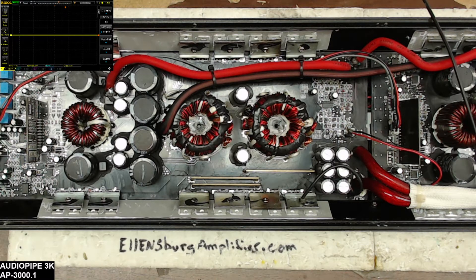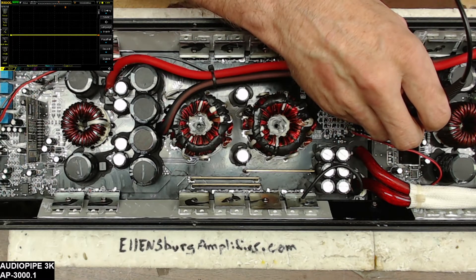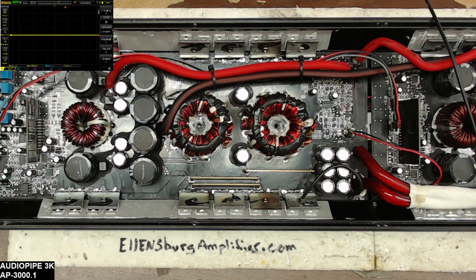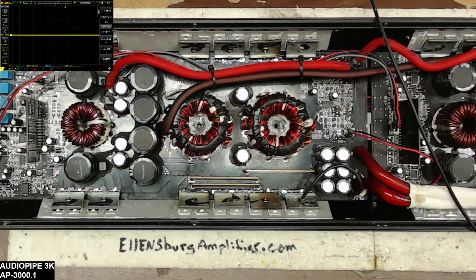So the next question is: why is it off? Why is the frequency so high compared to board A? They're both driven with the same 50 hertz signal right now. There is a small difference on the output between board A and board B from the preamp — about 400 millivolts. There's about a 50 millivolts drop on this cable, but that still doesn't explain the frequency change.